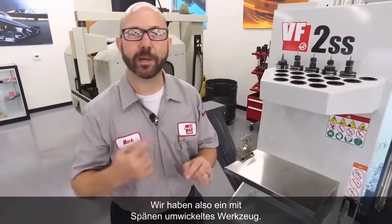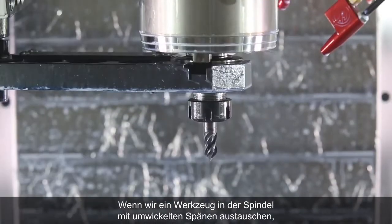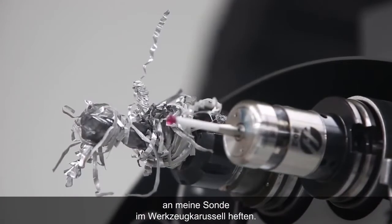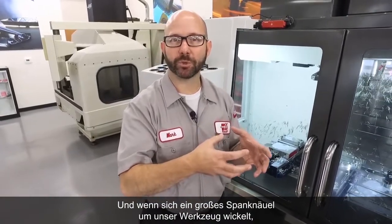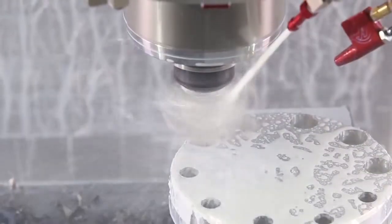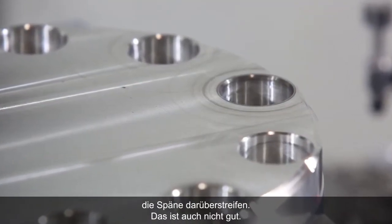So we've got a tool that's got chips wrapped around it. How big of a deal can that be? Well, it can be awful. If we do a tool change with a tool in the spindle that's got chips wrapped around it, those chips could get caught up in the tool change arm and cause a fault. Worse than that, if those chips catch hold of my probe in the tool carousel, we could have problems there as well. Also, if we have a big ball of chips wrapped around our tool, those act like a force field, keeping all the coolant away from our cutting edge. Our tool's gonna wear out prematurely, or worse, it could break because it's running dry. On top of this, we've all had parts that ended up with great big swirl marks across the face as those chips dragged across the surface. This isn't good either.